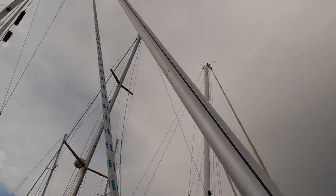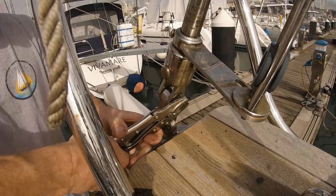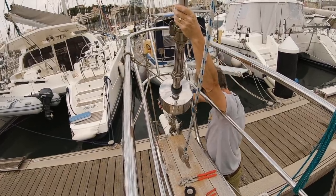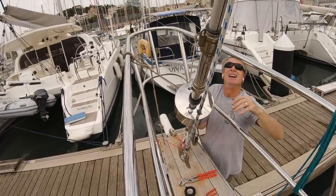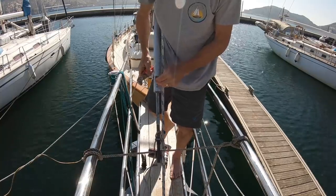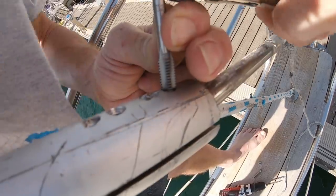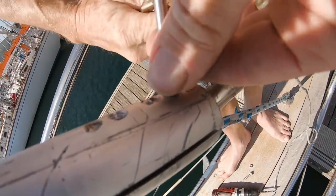The bottom swivel was seized. I'm having a go at taking it out as it is and then unseizing once I've got it off. When you try and bash out a cotter pin it's bound to go in the water, so tie things on. Nothing went in the water — amazingly. These holes have obviously been drilled before by someone. I'll widen them up and tap them out to take a bigger screw. I'll put a bit of dielectric grease on them — it's the dissimilar metals issue that gets things seized. It's a toss-up whether to use dielectric grease or Loctite, but you can put tape around the outside, which is what I do, as the aluminium is soft and the foil jiggles around and bolts work their way out.